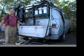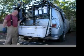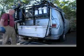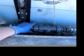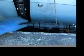How I get the thing rolling is I have a valve here that opens up the tank to my filtration process. I forgot to show — I have two Y-traps right here. This is 40 mesh and this is 80 mesh, and they're the first step out.